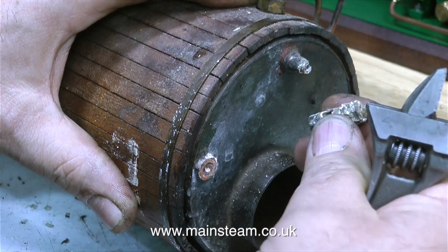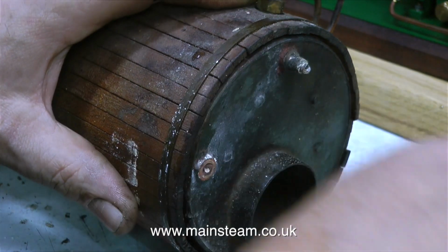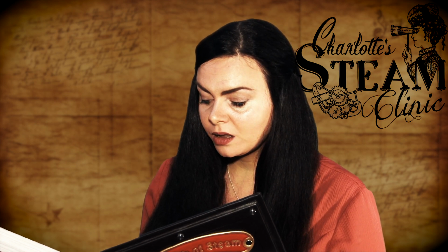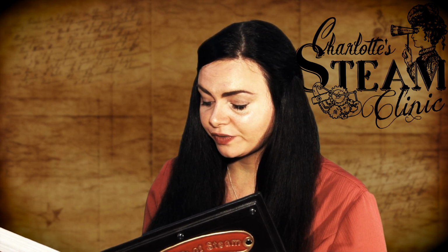Steel boilers are to be avoided generally. They can suffer badly from corrosion if they've not been looked after properly. My dad had a steel test boiler, and that was excellent. It was in good nick and internally rust-free. It always had corrosion inhibitor inside. When he used it, he always used the blowdown valve after every use to clear all the water from within.